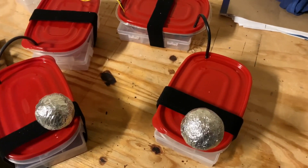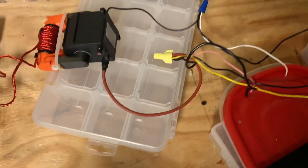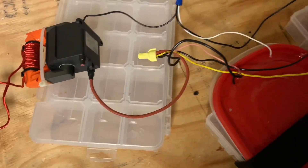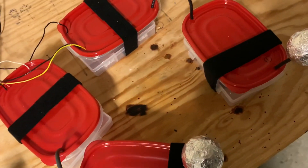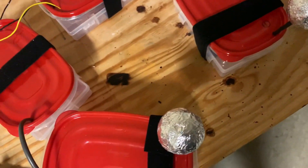I'm going to turn down the lights so you can see this working much better. I have my flyback transformer here and this can put out 30 or 40 kilovolts. You have to be really careful with these because it's very easy to crank up the dial on the variac and just blow out your 20 kilovolt diodes. So I'm going to try and stay reasonable with this thing.